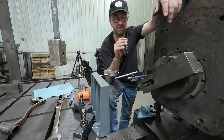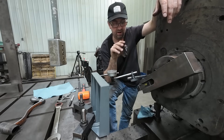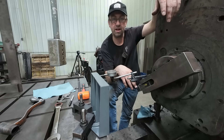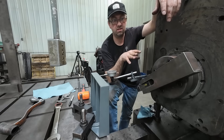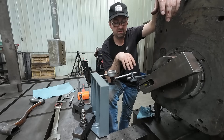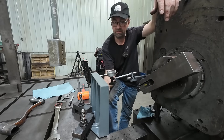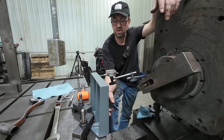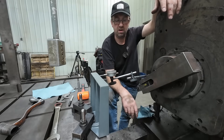There's some flex in it so I'll have to take nice light passes. I am using a CNMG insert on this cutter, but I'm using the wider angle — I found that works amazing on this thing. This is cast iron, so it'll cut pretty easy. We'll just take it slow, maybe a little coarser feed because you kind of want to match the original finish, which is a little coarse. But we'll see how it cuts.